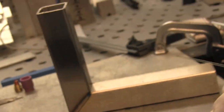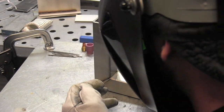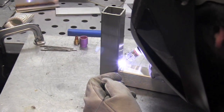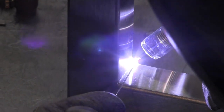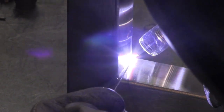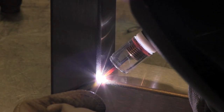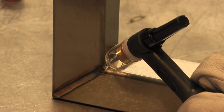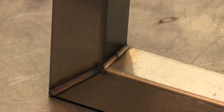The last thing is welding inside here, and that's what's going to pull it to make it square. When you're welding on the inside, it has a tendency to draw a little bit in the direction of travel, but in this case it can't really draw much there anymore because all the other welds are done and everything's locked in — but it will pull in the direction of where the weld is, so it's going to pull this thing square. About seven to ten seconds of post flow will maintain that good color, and that's done.